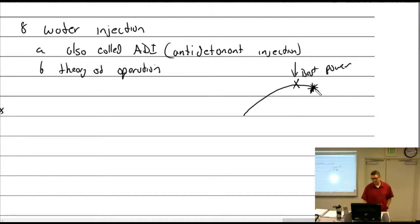So we've lost detonation and cooling, because we know fuel at higher power settings definitely has a cooling factor, because we can play with the mixture. We know it's rich at peak, lean at peak, and all that. So fuel now can be set at best power, which means a loss of cooling.